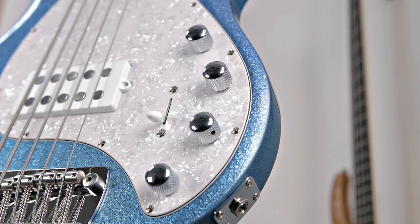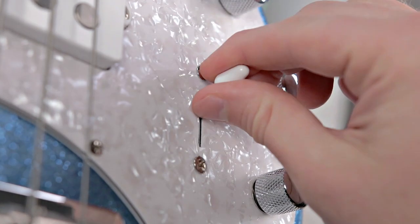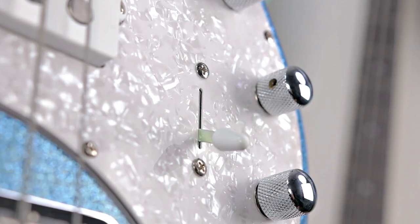What makes this really special is the three-way pickup selector. When the selector's in the front position, your humbucker's in series. In the middle, it's series with a filter. And then all the way at the end is parallel. So not only do you have this super versatile preamp with the tried and true sound from the humbucker, but you add even more options by having those three different pickup configurations on hand.